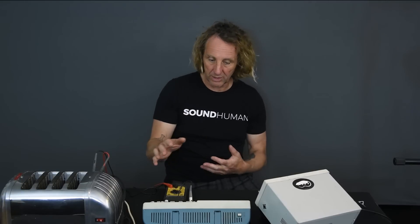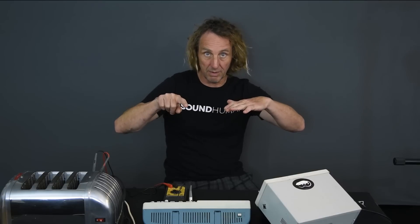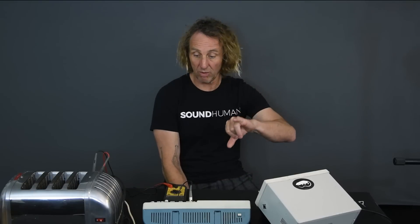It's one-tenth the voltage, right? 120 volts wall voltage, 12 volts car battery, 24 volts — you can grab 24 volts and it doesn't bite you. Why is it that we get so zapped by 120 volts wall voltage and can't feel something like 24 volts? I think the logic is that a lot of people who know electronics have known about RMS versus peak voltage versus peak-to-peak voltage, but never really processed the fact that 120 volt wall voltage is its RMS voltage. Its peak voltage — from the zero line to the plus or minus — is the square root of two times more, 1.414 times that 120 volts. So that's about 170 volts — it comes out to about 169 and change. So really, the peak voltage on the wall is not 120, it's 170.